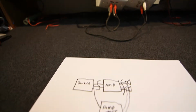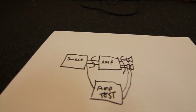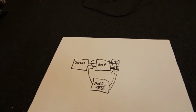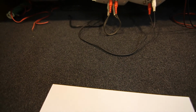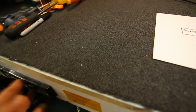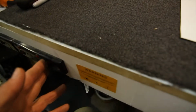And like I say, if something starts exploding on you or cooking on you, some electronics burning up and the smoke coming out of it, you can switch it off straight away. You don't want to be leaning over the unit to get to the back somewhere and turn off a power point, because that's the last thing you want to do if it's starting to spark or something. You don't want your face or anything near it, so if the power point's here, you can just automatically flick it off, and it becomes a habit. You know where it is, and you always just tend to reach as soon as you want to do some work on the unit. You know where the switch is and just flick it off.